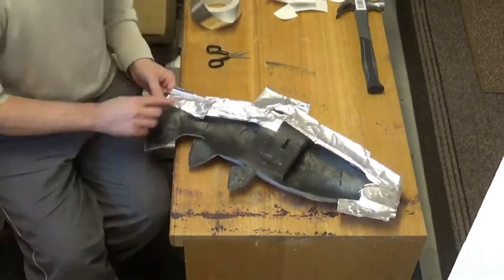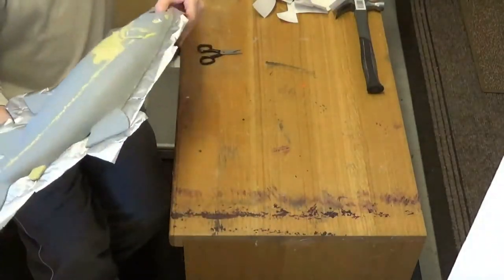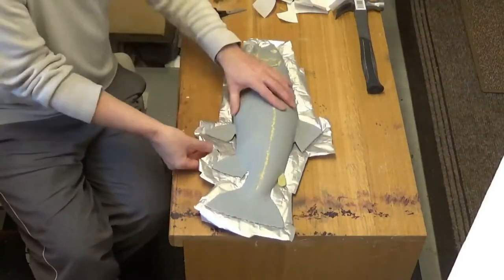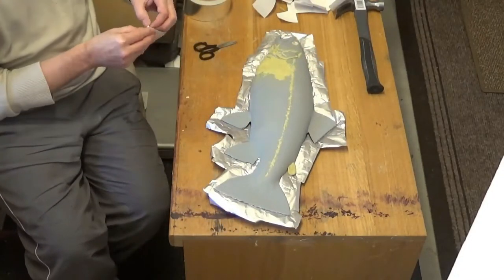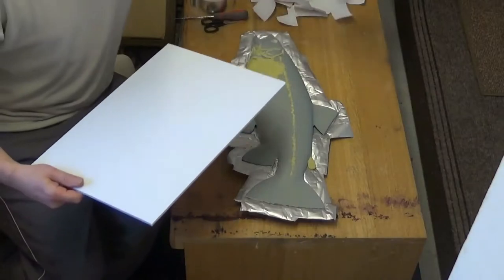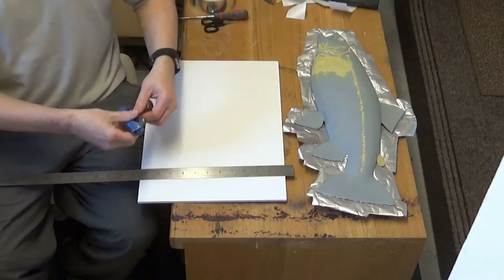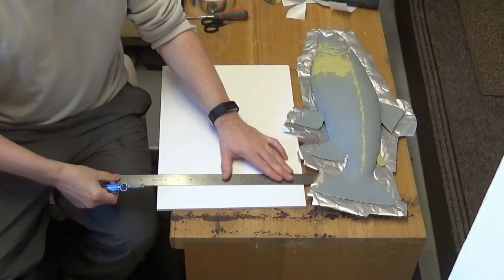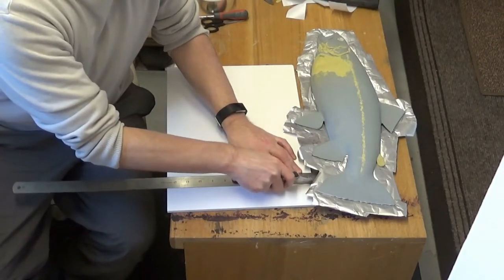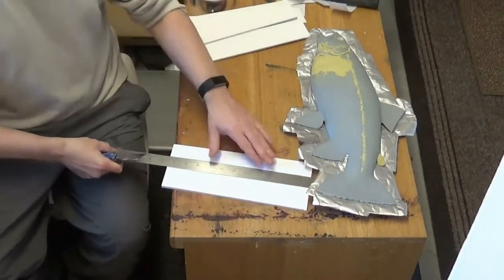While I'm applying the foil tape I double check to make sure the foil is stuck nicely onto the fiberglass fish and also iron out any creases around the fish. I'm using a screwdriver to do that there, and I've got a piece of foam board which I'm going to cut up into pieces and fit underneath any of the gaps underneath the fish and where I've put the foil template in.